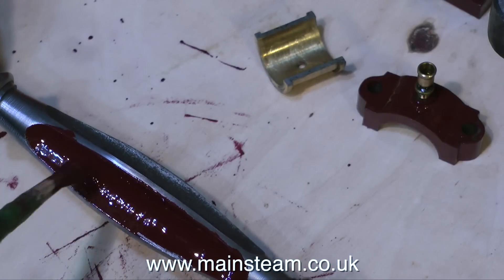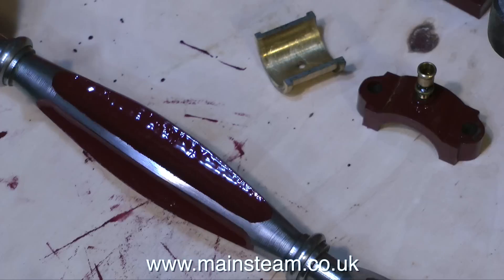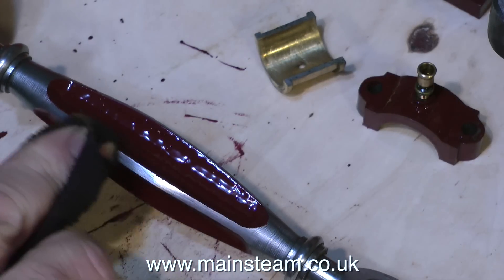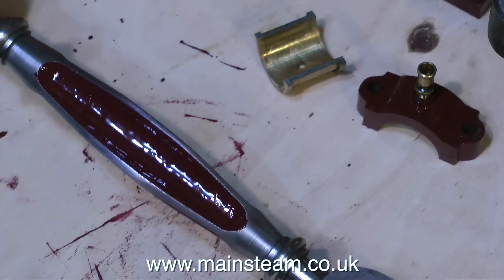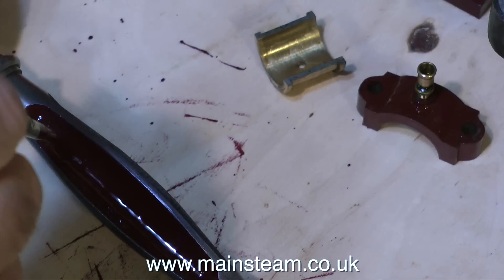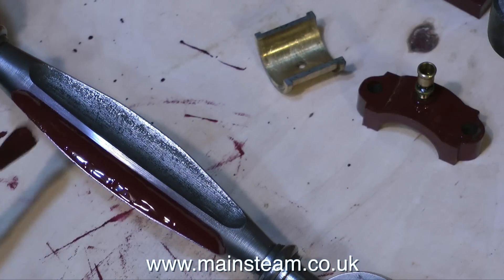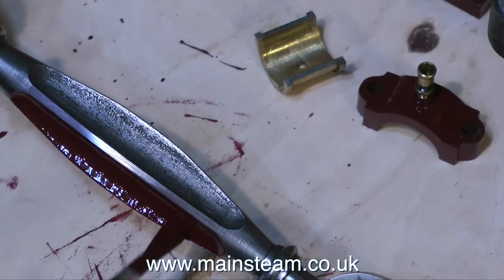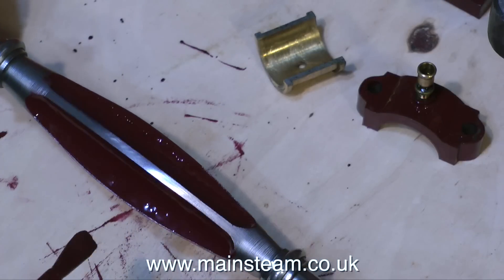Now I'm painting the connecting rod. These scallop parts of the connecting rod look really good when they're painted. You will get paint all over the connecting rod, and if you wipe it off like this it's not a really good idea, because you'll see that you've wiped off part of the red. It's best to just leave it, and when the paint is dry, rub it off with a piece of emery cloth — that way you will get a cleaner edge. This ornate connecting rod is a really important and very visible part of a beam engine, so take your time to make sure you get a good finish and don't get any runs or drips on the red part.